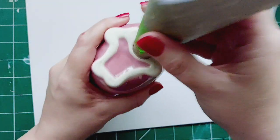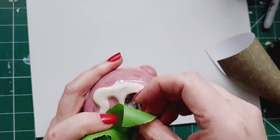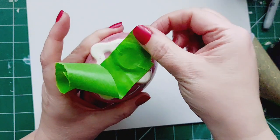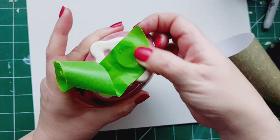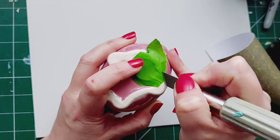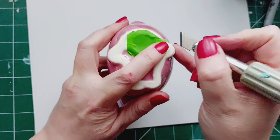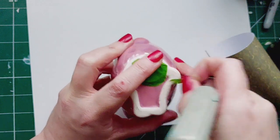I was also really nervous that if I used sand, it might just fall out everywhere on demold. I figured the garden stones would add the weight that I need, but also, if the tape was to come off, it wouldn't really make too much of a mess, like sand or rice. So yeah, this worked perfectly, and I can tell you this was a huge success.